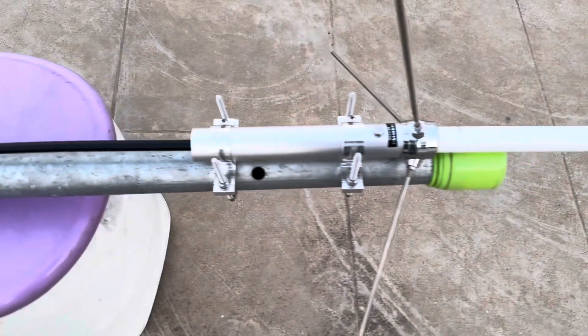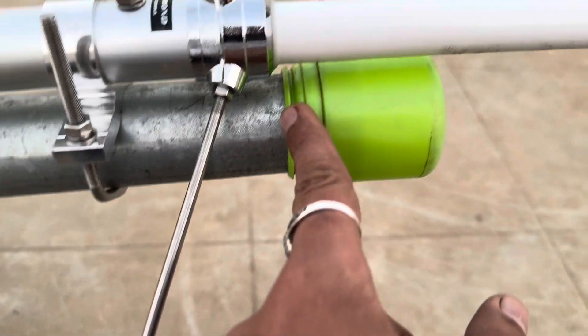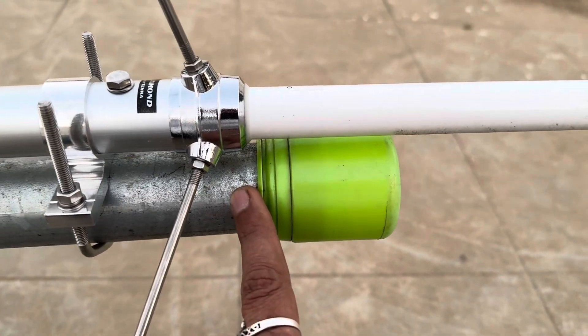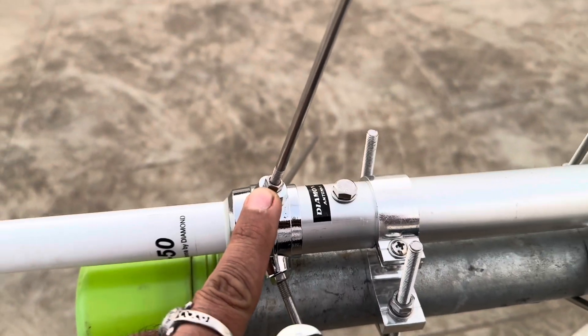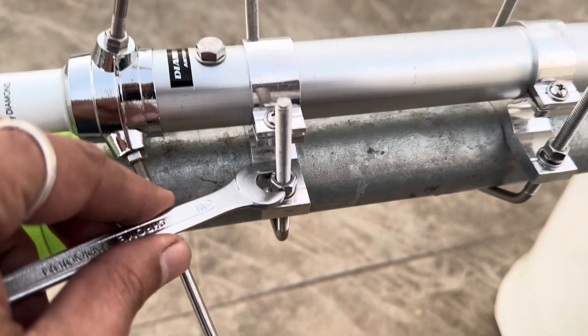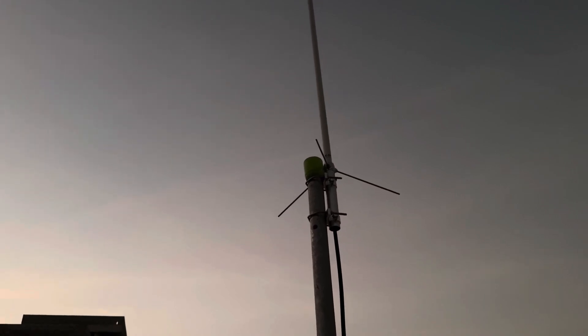This mount is very easy — remove the two bolts and it acts as a cantilever resting on a stool. I need to push the antenna up by two inches so the element doesn't interfere with the GI pipe. You require three spanners: number 8 for tightening the radials, number 10 for the clamp and antenna mounting bolt, and number 13 for the nuts mounted on the base. Finally the antenna has been erected properly with no interception between the element and the GI pipe, and there is a green cap on top.